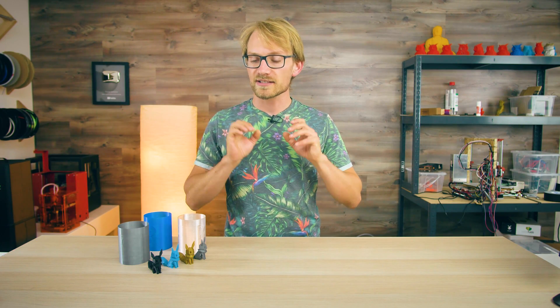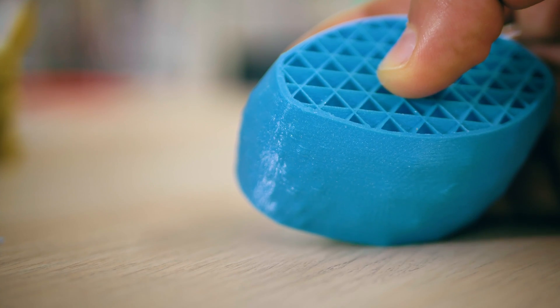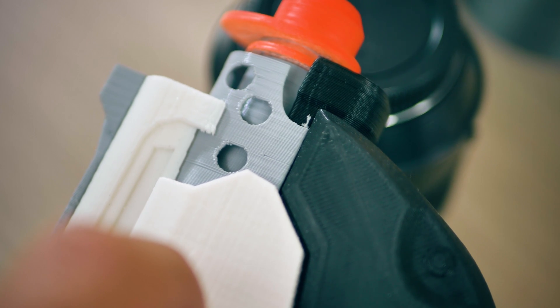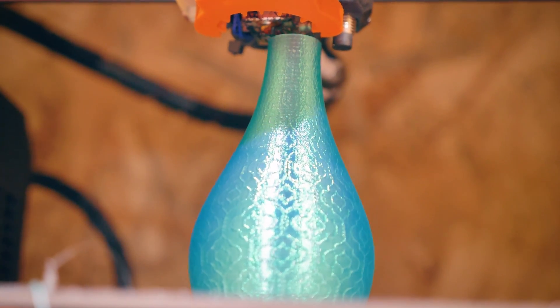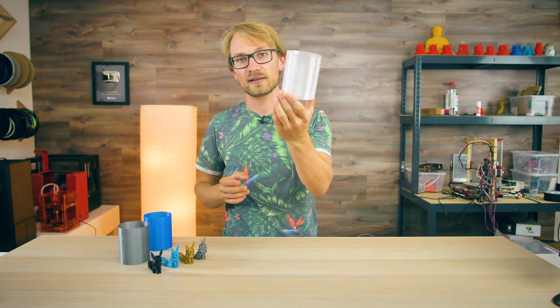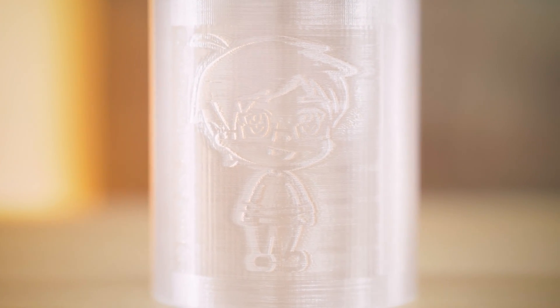In essence, Velocity Painting is a really simple concept. Did you ever notice the little pimples or under-extruded bits at the start or end of a line in your 3D prints? Those are there because while the motion system is very good at changing speed and direction quickly, your printer's hotend is not. It can't just go from extruding slowly to pumping out tons of material — it always has that bit of lag to it. Most slicers and printers try to work around that limitation with a ton of different tricks, but what we're doing with Velocity Painting is intentionally using that lag to create patterns, images, and text burnt into a 3D print. You take your slice, a ready-to-print file, and an image that you can overlay, and the Velocity Painting tool will turn that image into speed variations in your 3D print that you can actually see in the finished part, without actually modeling anything into your 3D model.